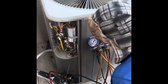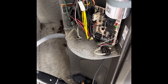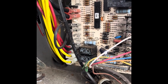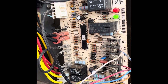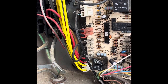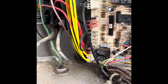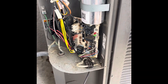One thing before you pump down the system — I did jumper in here. This is a Lennox system; it says 'Low-PS' right here. I have those two terminals jumpered together so the low pressure switch will not turn the system off when it gets below 50 psi, keeping it running so we can pump it all the way to zero. That is one thing you will want to do when pumping down your system to get it to zero psi.